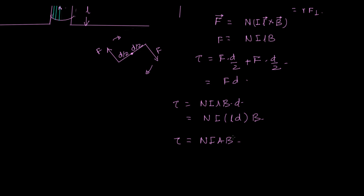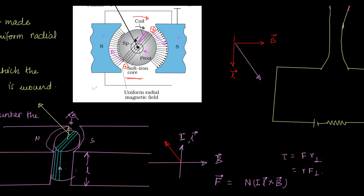Get that? Now what happens as this turns, this helical spring comes into picture. This helical spring normally is like that, right? Now the moment you turn it like this, you are kind of trying to expand it like that, right? It'll get expanded. This thing will come here, and this thing will come here, and this is rigidly attached. It does not move. So what happens? You tend to make its diameter more, right? If you see, this is connected with the shaft that moves, that pivot, and this starts moving.